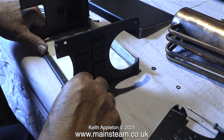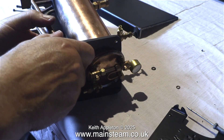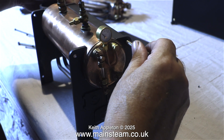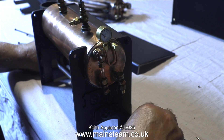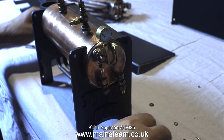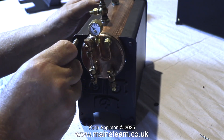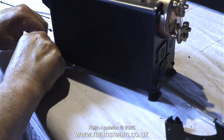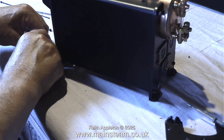The construction method is quite different. These rods go through holes in the main castings and they're quite fiddly to locate, but once you get there and put the nuts on it's okay. Unlike the 504, you can actually insert the boiler once a 501 or 500 series boiler is partially assembled. Because of the different size of a 504 boiler, this method doesn't work well as you would bend the side panels. But on these smaller boilers, until you tighten up the threaded bars, there is sufficient play in the rods to allow the boiler to be inserted.